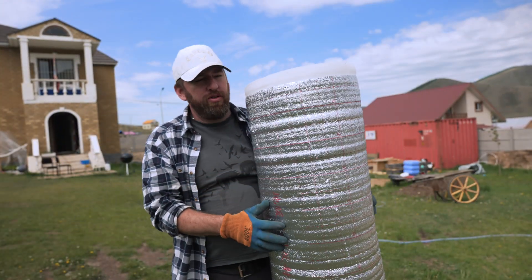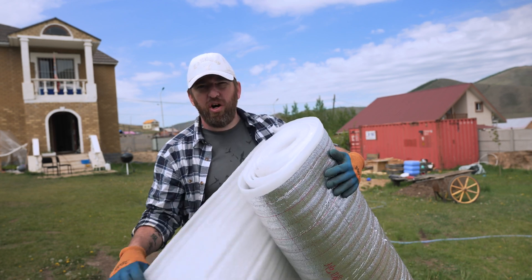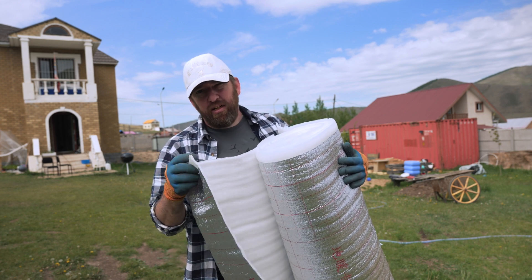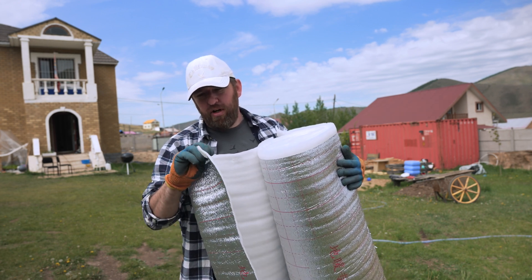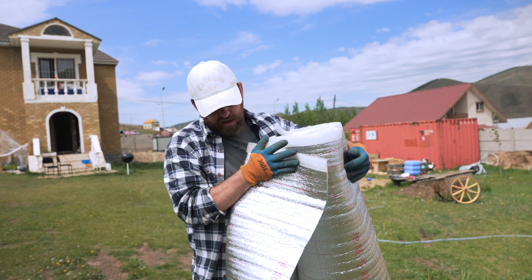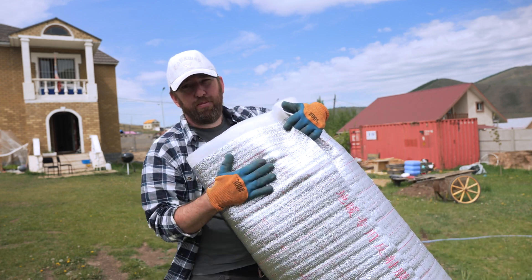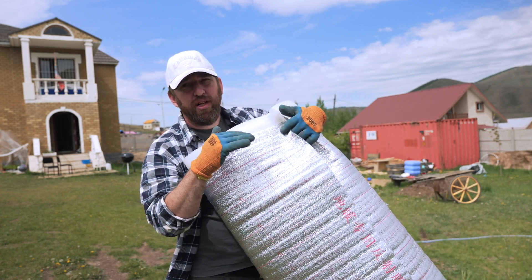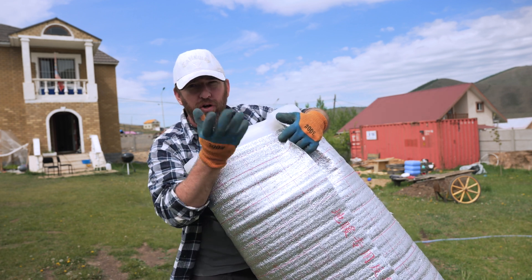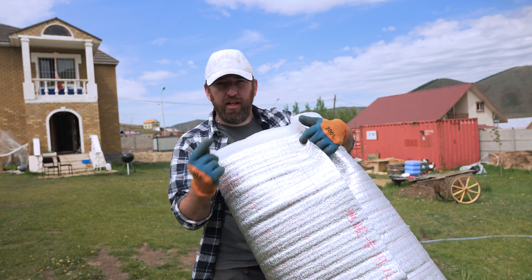While Zula is finishing off the last of the paint, I'm going to cut this product — overseas you'd call it Sill Seal. It is a rubber foam product, mainly for flooring, and it comes in rolls with lines on it so I'm going to slice it up. This product is going to go between the concrete and the wood, and that's going to prevent any moisture being sucked up from the concrete into the wood. So I'm going to start cutting this up so we can install it and then install the wood.